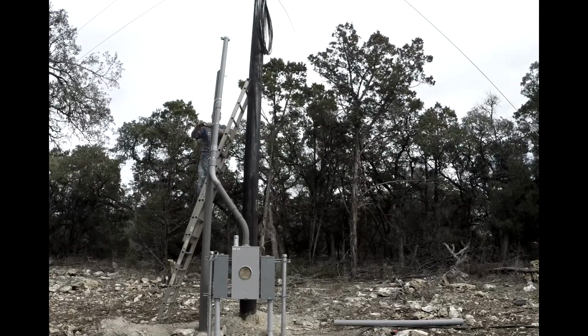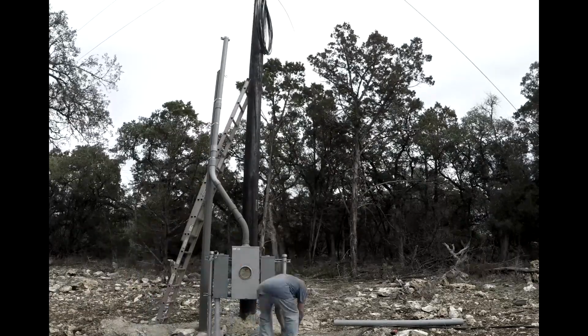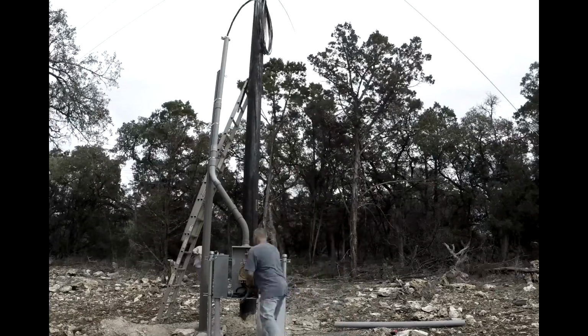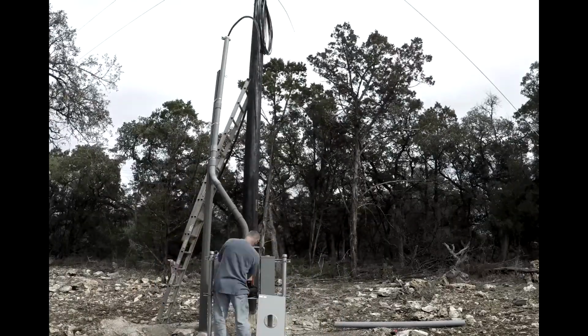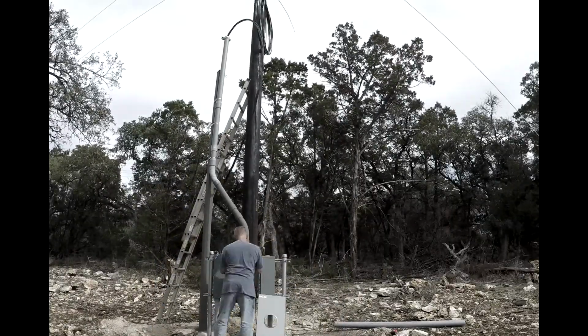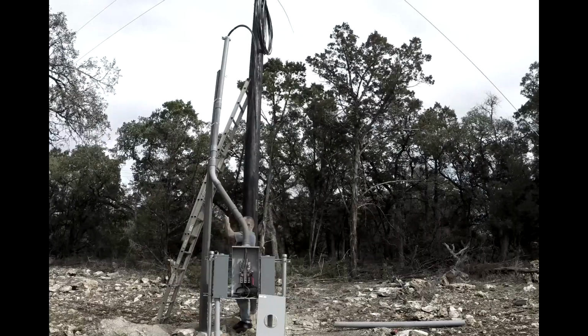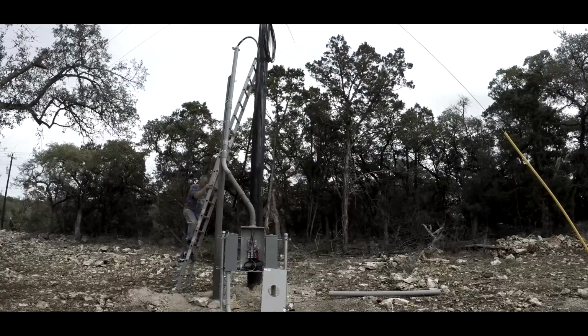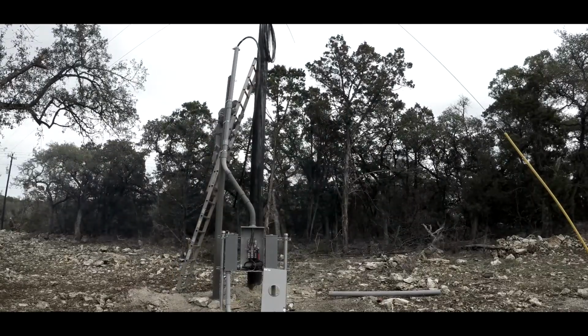To attach the PVC to the pole, I basically used screw clamps to hold it on there. A couple of steel ones, I think I used 3 or 4. And here you see where I was pushing the wire through the weatherhead. The weatherhead comes apart, and you basically just thread. There's a plastic separator, and then a metal pad that goes on top of it.